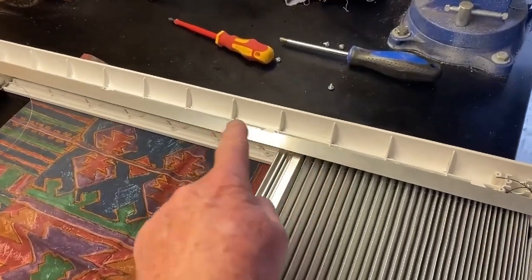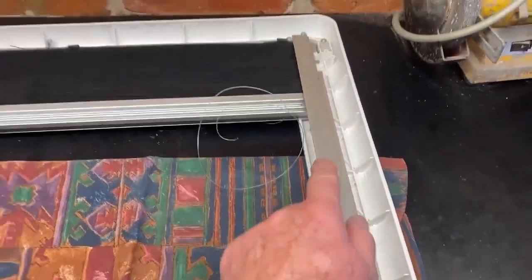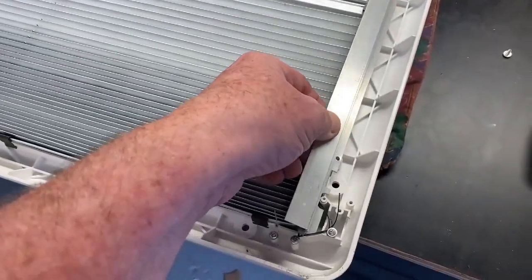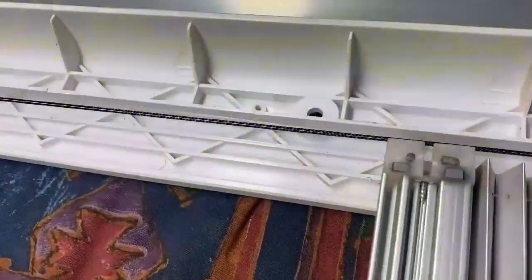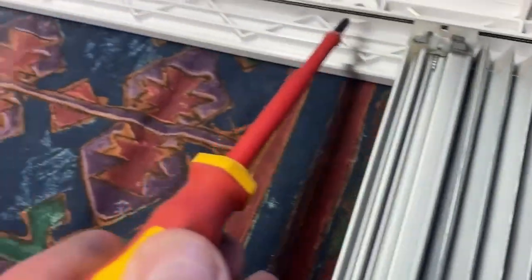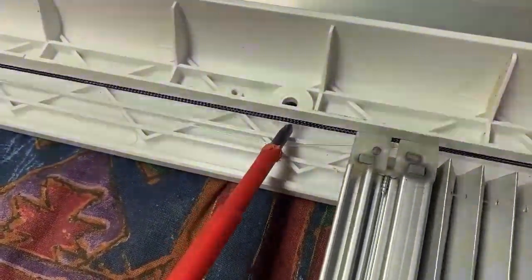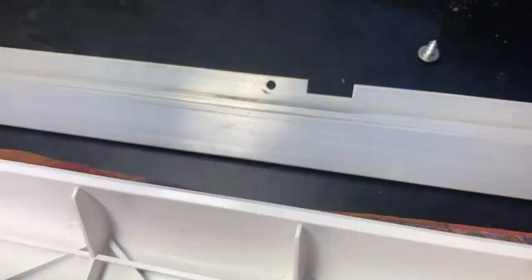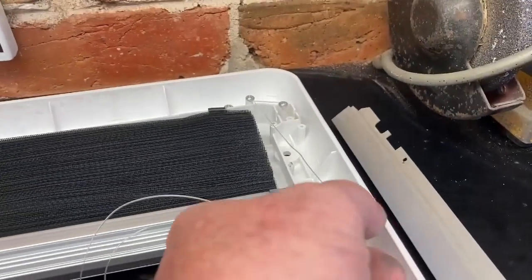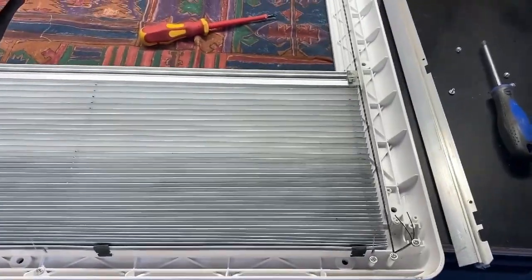The next thing we have to do is to take this side rail off the screen. What we do is remove the screws that are held in place here. Just take all of the screws out and once you've got those screws out, just simply rotate it a little bit, give it a little wiggle, rotate it and put it aside. This will expose all of the mechanism here. You can see from this perspective that you've got the strand — the black strand is for the fly screen. And below that we've got the fishing line for the main other screen. That fishing line goes all the way to the top and hooks on to another connection point, and on this end it goes all the way in here through this channel and up and around. So we'll have to see how we can adjust that and get a new strand in there.